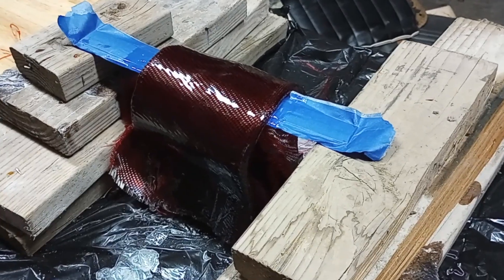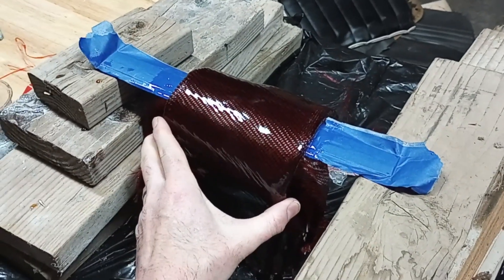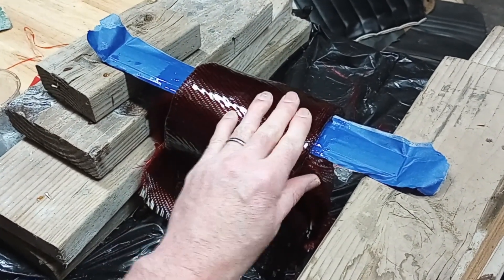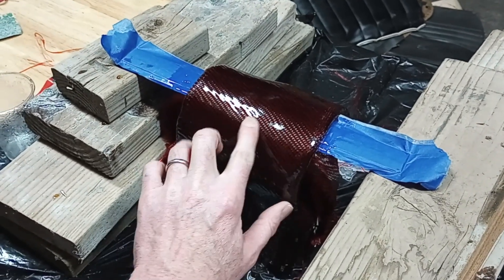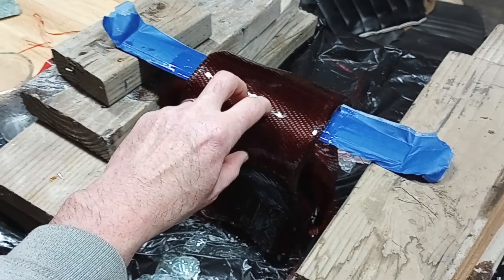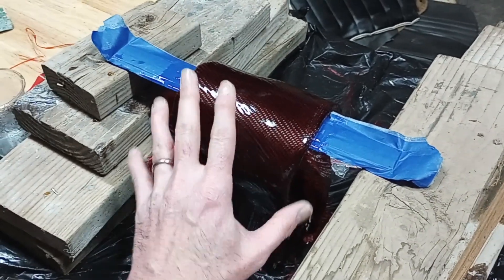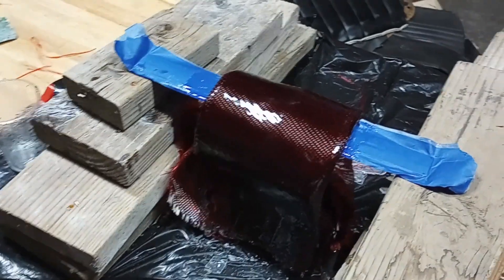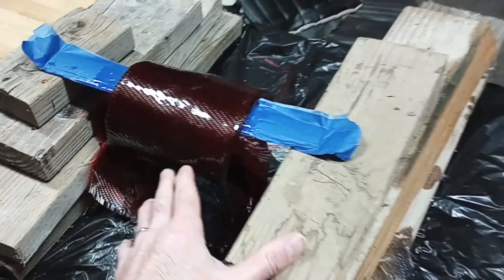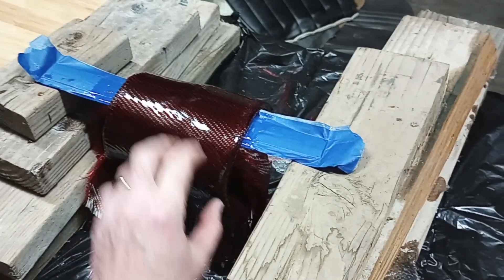Here's our part after it has cured completely. This is three layers of top resin to give it a finish. What I was targeting was not being able to feel the carbon cloth — I can feel some of the striations in certain spots, a little bit of bump, and that's exactly what I was hoping for. This has cured for two days now after the last coat. Now I need to take the silicone boot out of the center, so I'm going to dismantle this apparatus, take the ruler out, and start cutting this out.